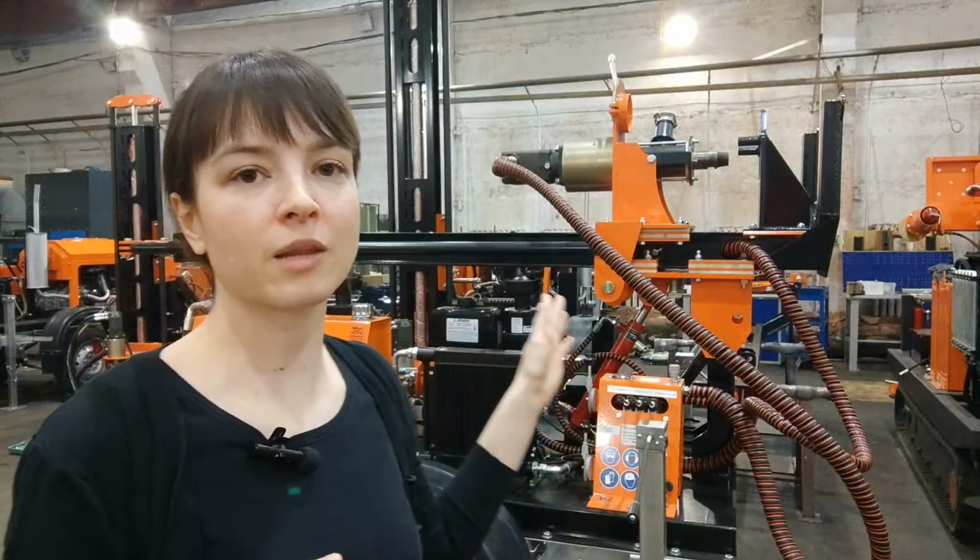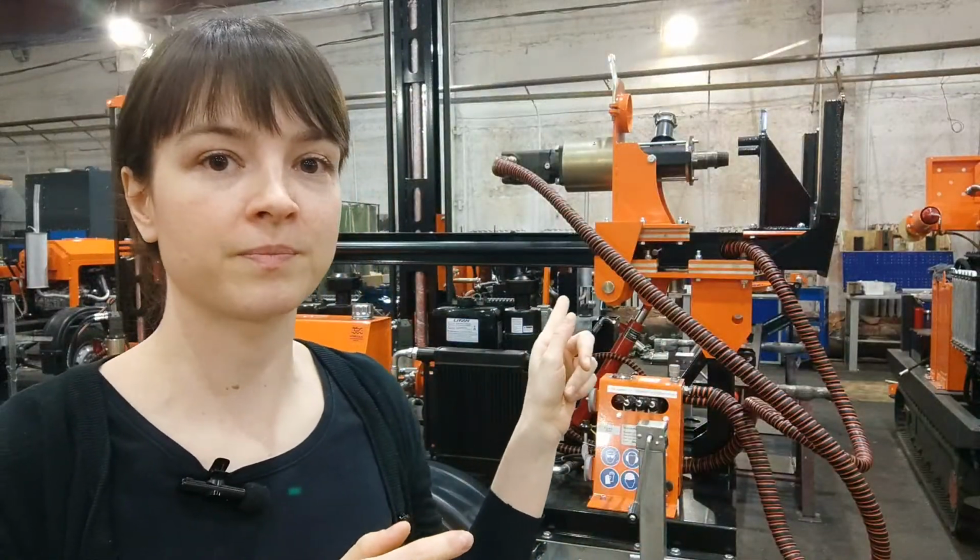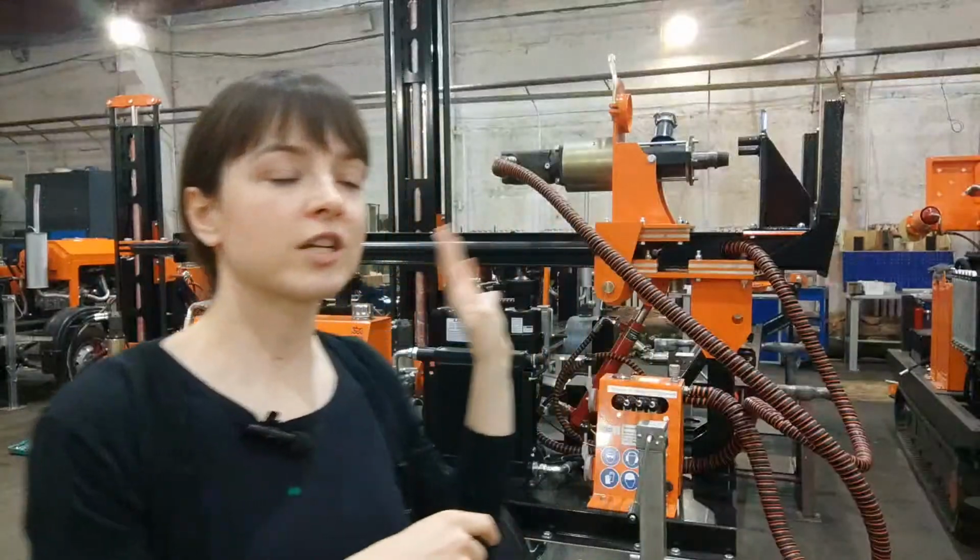We'll get back to the drilling methods. What type of drilling can the GBU-30L perform? The general answer is that all of these types can be covered within just one machine. You can use different types of tools, but in general, you can drill using the motor pump, in which case you would perform wet drilling, in case you have some soft soil. Then you can drill with the GBU-30L in hard rocks, which leads us to air drilling with the compressor.